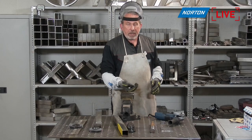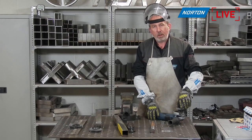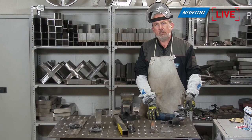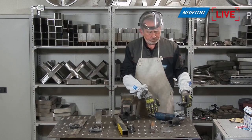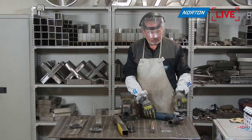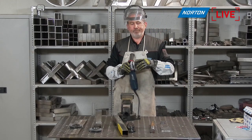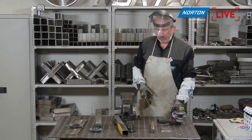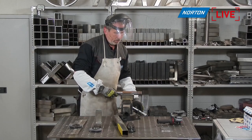It's much heavier than the other brushes. And we have different thicknesses of wire. The crimped wire we have been using before is 0.3 millimeters. This one is 0.5 millimeter. Each wire is even thicker. And it is very good, as Paul says, for welding. For instance, if you want to re-weld an area, you want to remove a little bit of the old welding line, you can do it with this, and then after that you can re-weld the part. Yeah. Or add a new layer of welding in some cases.